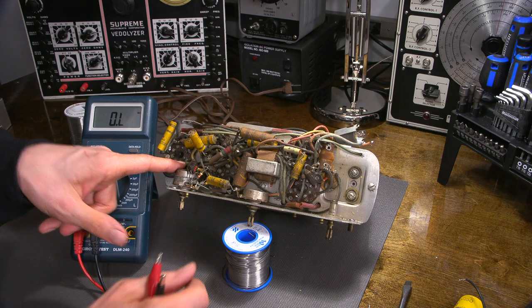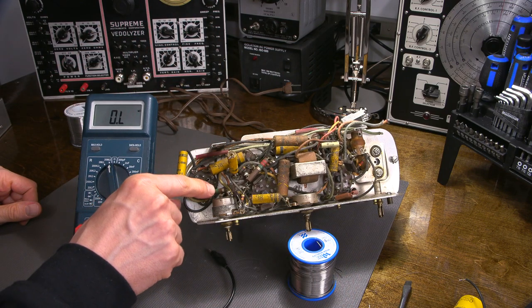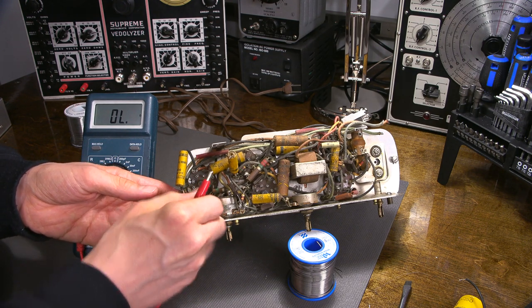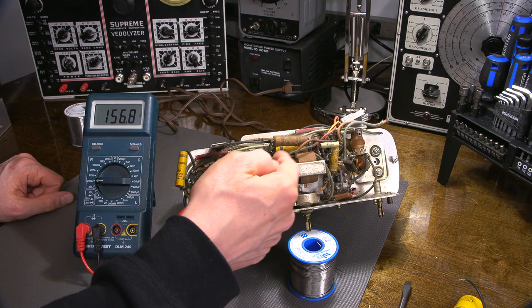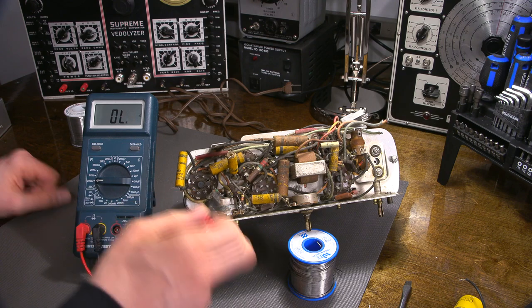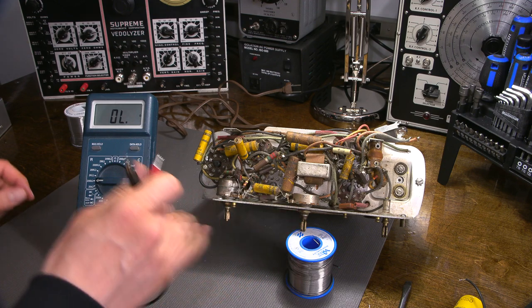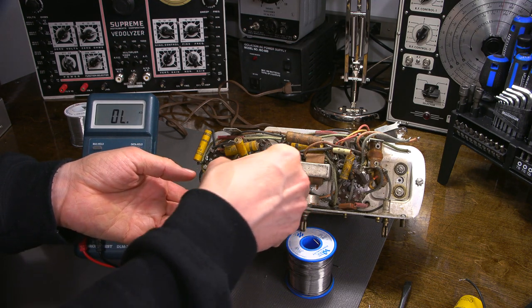There's a 150 ohm resistor down here - brown, green, brown is 150 ohms. Turn this down to 200 ohms range - 150 reads as 156.7, no problems, that resistor is just fine. These are composition resistors and most of the time these fail because of moisture problems. But as I said this thing has been baking itself for years so these resistors are probably nice and dry. There's a 47k ohm resistor here with no fourth band - that means 20% tolerance, quite a wide range. That one reads 45k - no problems. There's a 1 megohm here - brown, black, green, again no fourth band so 20% tolerance. That one reads 1.09 - absolutely fine.